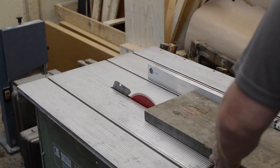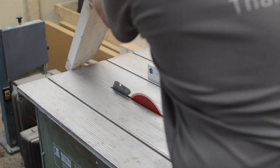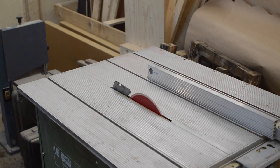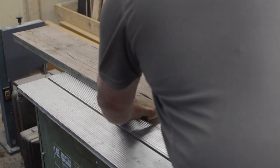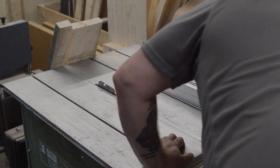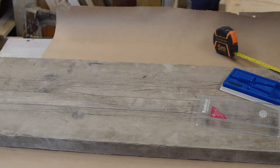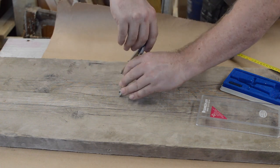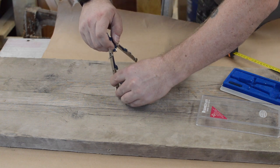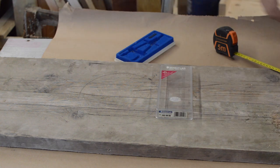As I said previously, when all else fails, get some scaffolding boards, and these can be roughly ripped down to approximately 6x1. The stocks have three holes in them, obviously one for the head and two for the wrists. The head hole is between 7 to 8 inches in diameter, and the wrists are roughly 3.5 inches in diameter.